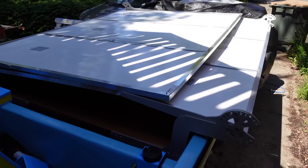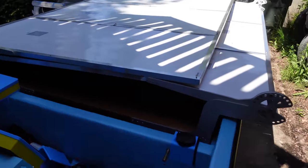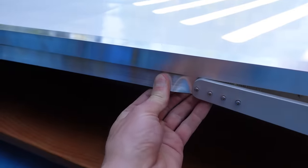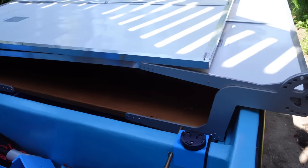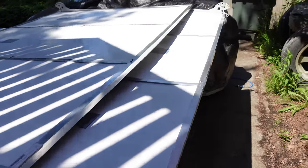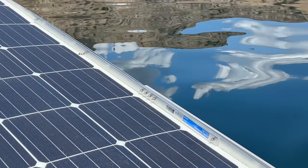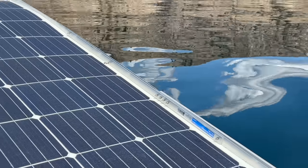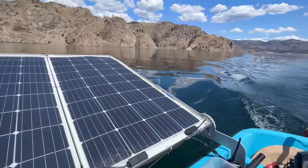Until this happened. I just tried to fold them up, and the weight of the top panel rested on the bottom panel, and this aluminum just kinked. That goes to show that these pieces are not strong enough — need to rethink that one. After that happened, I bolted on some 1/8-inch aluminum strips over the weak parts to add strength so they wouldn't fold again. That seemed to work out pretty well.